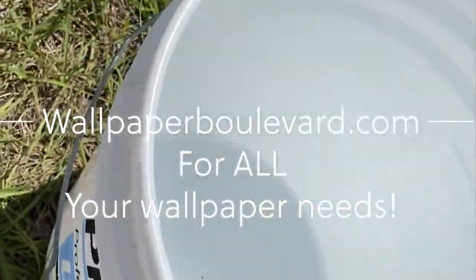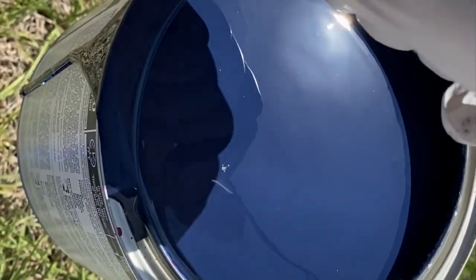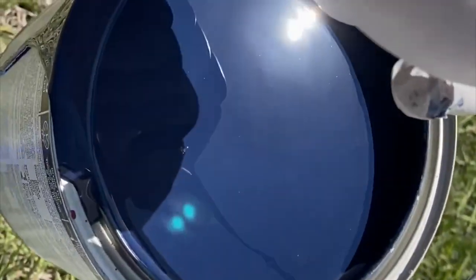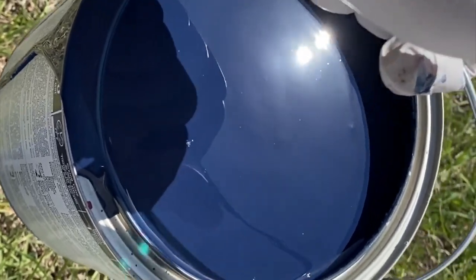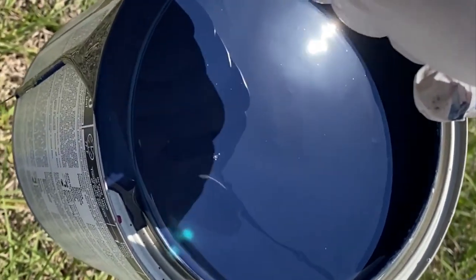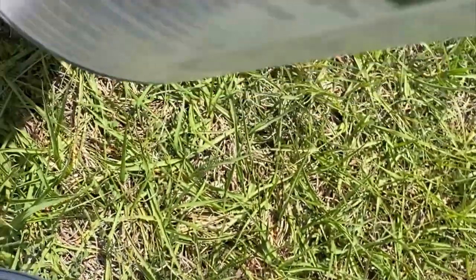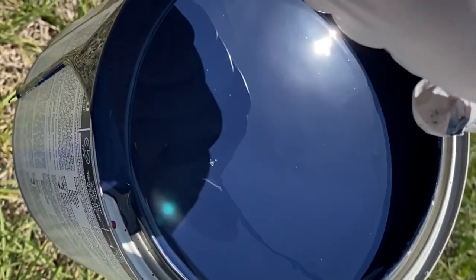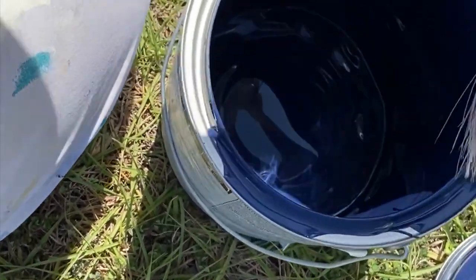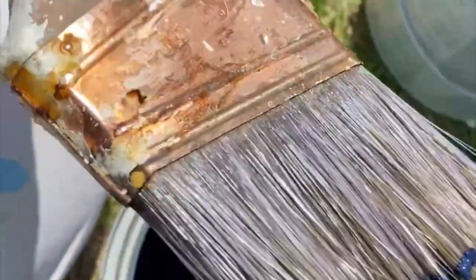Angular flashing is the effect of the texture applier, the person who does it, applying the texture instead of straight ahead holding the applicator, he or she turns his or her wrist back and forth, applying the texture, causing the light to reflect against these texture particles at different angles. And so you might see a wall that looks dark here or there. You might think it's your paint, when in fact, it's your texture.